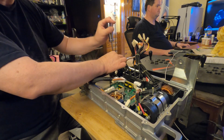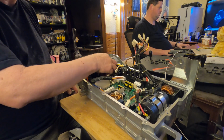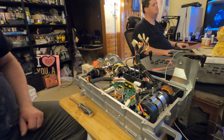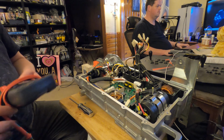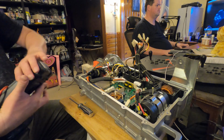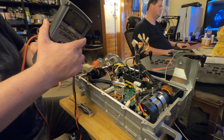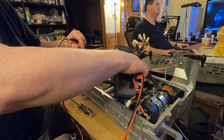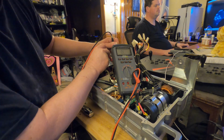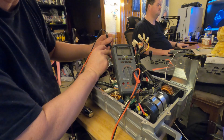Okay, that one came out nicely. So in disconnecting this part from the board, what this does is ensure that there is no parallel path for current flow, because that's what this is in effect doing, measuring basically the voltage potential on it. So once again, our handy dandy meter up here. Let's see what our numbers are now that we isolated it. So this was the positive. And this is what we mean. So that was where I thought we had our issue.